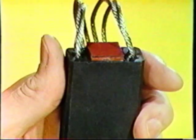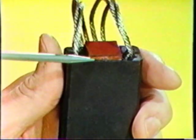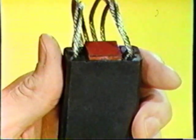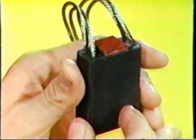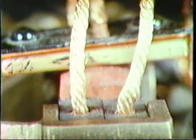The Helwig red top is composed of a top layer which is a hard fiber and a bottom layer which is a high temperature resilient rubber. The hard fiber top protects the rubber from damage by the spring finger and distributes the spring force uniformly to all brush sections.